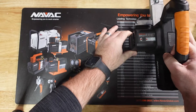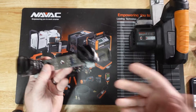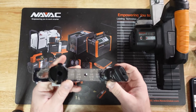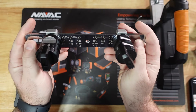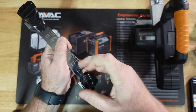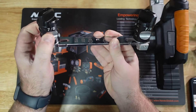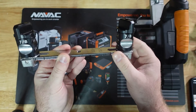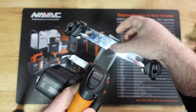We'll take the tool itself, set it outside, and grab the T-bar. For this demonstration I'm not going to bend three-eighths — nobody wants to see that. We're going to max the tool out with some seven-eighths ACR soft copper. According to our quick guide, seven-eighths copper is going to be in our number-one position. Loosen the wing nuts, pop the assemblies to the ends in that number-one position, and re-tighten. Much like other crossbow benders on the market, the T-bar will fix to the tool.